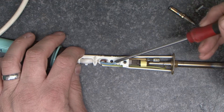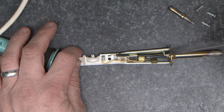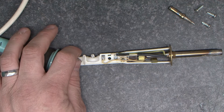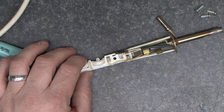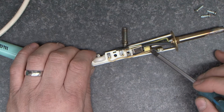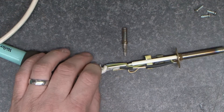We've got the power input here. We've got an ESD ground earth terminal that goes to the shield — on my power supply there's a little tip on the front that I can connect to ESD. When we look at the wiring, the power comes in here, goes to the switch, out here to one end of the heater, and the other end of the heater is directly connected to the other cable.